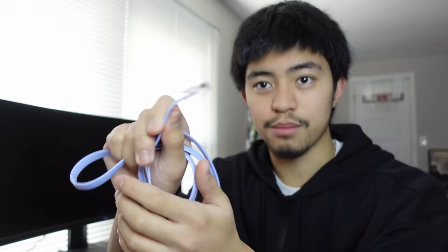To console into the switch you're going to need a console cable like this. One side looks like RJ45 and the other side is USB. You're going to plug the RJ45 end into the console port on the switch and plug the USB side into a laptop or computer.